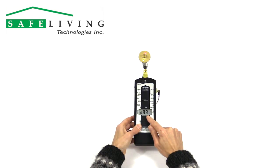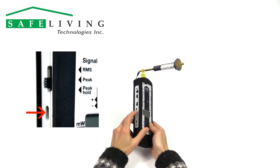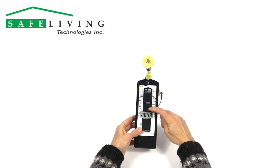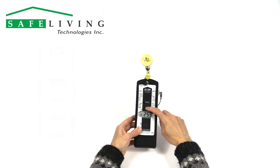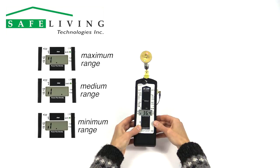Note that after displaying the highest measured value, the meter reading will slowly decrease until a higher peak is measured. This peak hold droop or decay time can be changed with a switch. The plus setting is standard and the minus setting is a faster decay time. If you need to clear this peak held value, simply press and hold the clear button. If the display is showing only a 1 at any point, increase the range switch or attach the DG20 attenuator if needed and continue scanning.